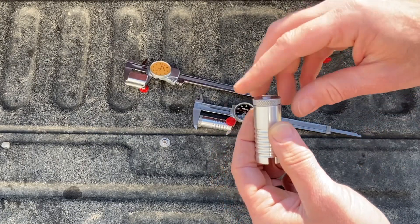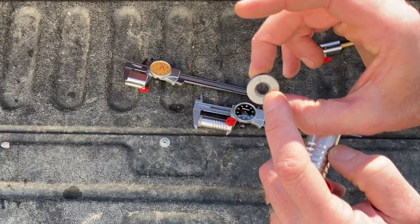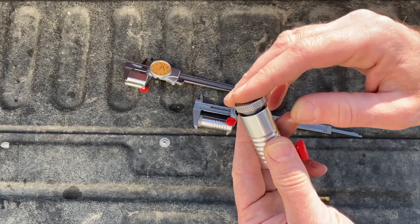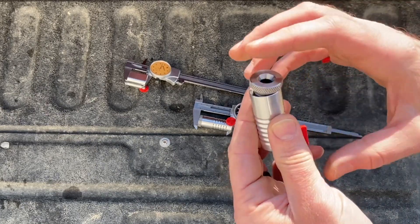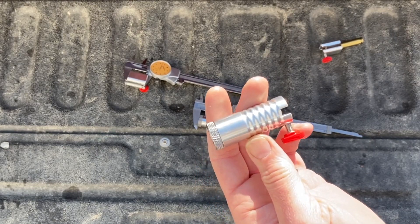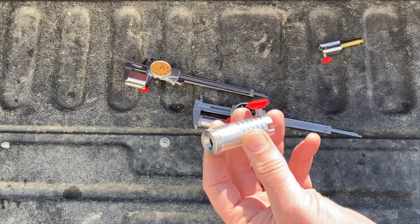It'll be easy for us to make basically every single version that we're currently making, plus more. We can go ahead and make these with caliber-specific angles so you could use this as a bullet comparator as well to do base-to-ogive measurements. We've got really nice clean machine work, nice soft edges, so no matter what it's going to find its way in there, and it's been working out really well.